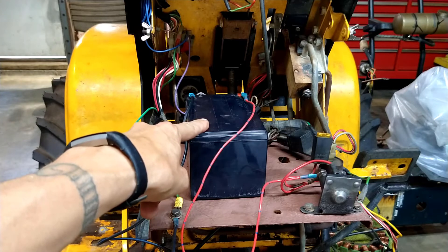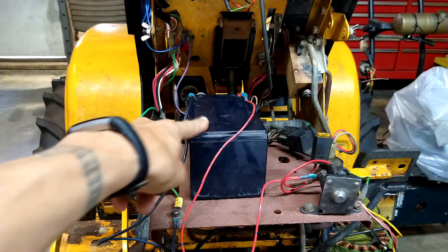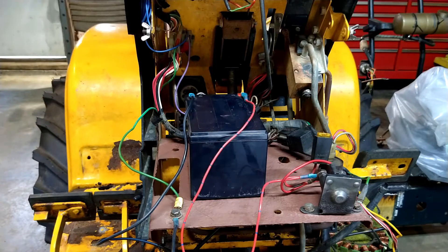I've taken out the original battery and put just a temporary one in place to show some of the operations without having a big bulky battery in the tray. The engine is removed - it would normally be right here. Some things are removed, but it makes it easier to see what's going on. I'm in the process of going through the system and making sure everything's functioning. We'll address in a later video the more in-depth problems. But in this video, we'll go over each of the system components, where they're located, and touch on basic functionality. Here's the basic schematic: battery, starter solenoid, key switch, brake interlock switch, PTO switch, two seat switches, reverse relay, reverse switch, the PTO clutch, voltage sensor, fuel sensor, indicators, an hour meter, and lighting.